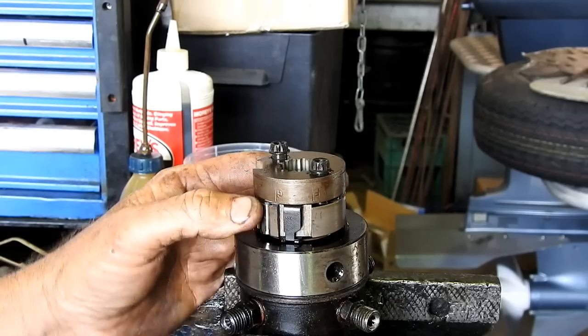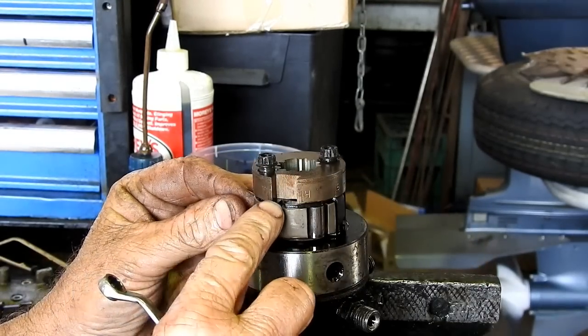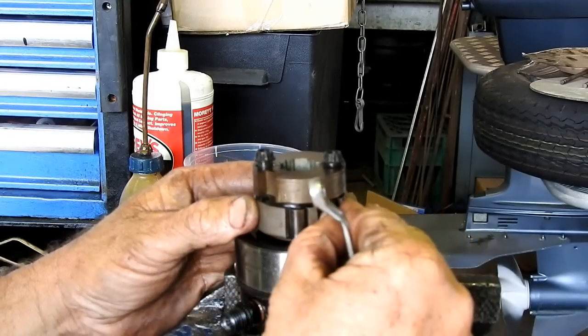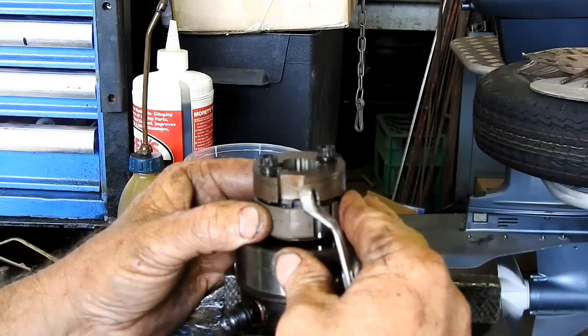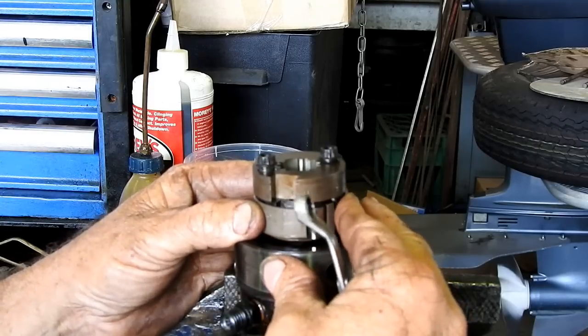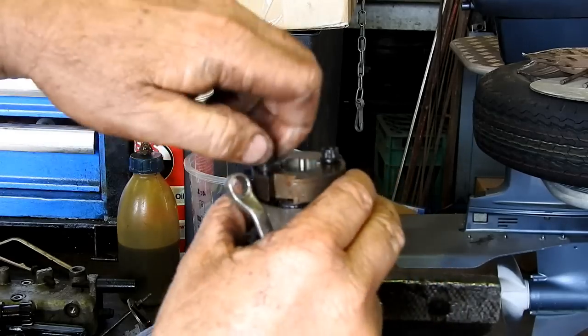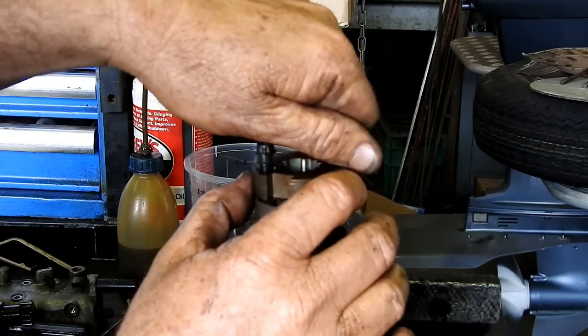So now you can adjust the fuel by moving the groove here back and forth. It actually adjusts the fuel setting on your pump. That's all it does. You can do that through the side. You can hot your tractor up to buggery if you want to. Anyway, we'll pop this top off. Pop the lock ring off.